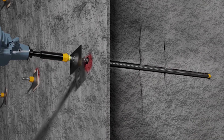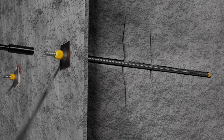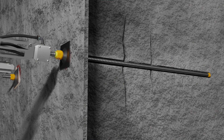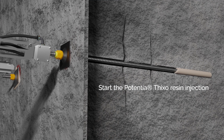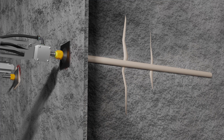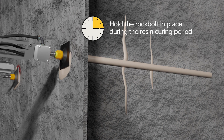As we are mixing the pumpable resin via static mixers just before injecting into the bolt, there is no question about mixing quality. Additionally, the pumpable resin is able to penetrate into cracks and voids inside the rock mass, which helps consolidate the ground and achieve encapsulation of the bolt. When we have a bolt type that can be installed repeatedly with a high degree of confidence, this is the bolt type that opens the door to bolting automation.